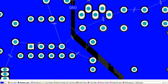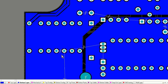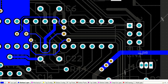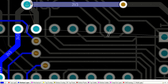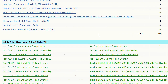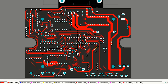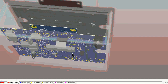So all of my heavy current is going to flow through the right side of the board, and the blue ground plane there on the left-hand side, that's all signal ground. So there's no real current flowing through that, so there's going to be no voltage drop through that, and therefore all of my sensitive signal stuff, my ADCs and DACs, will be at the same potential because they're at the same ground potential, because there's no current flowing through that left-hand blue part of the ground trace.